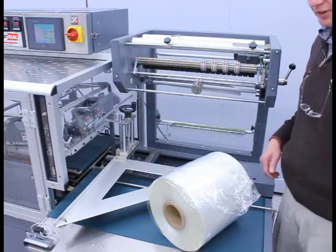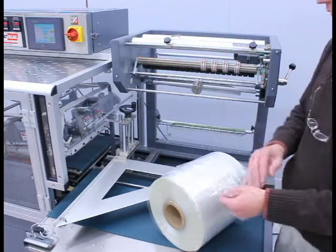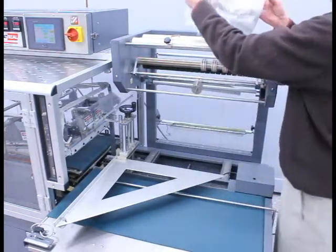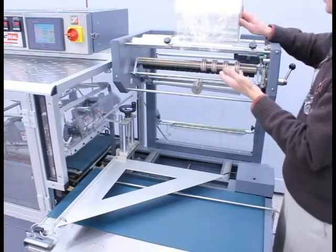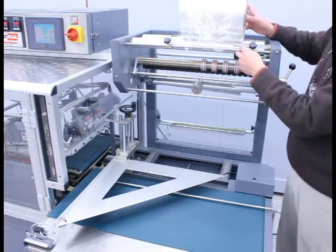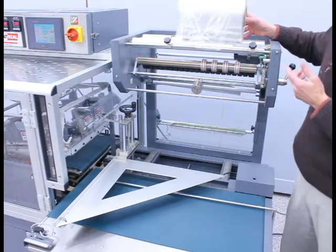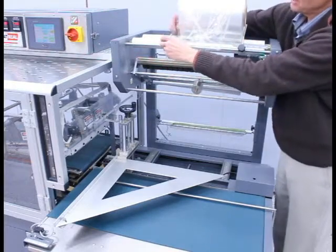The HDSA1721 uses center-folded polyolefin shrink film. The first step is to locate the open side of the film. The roll is simply loaded with the open side of the film facing the electrical control box. The roll can then be slid over to match on the scale the approximate height of the product — for example, a one-inch high product places the edge of the roll at the one-inch mark. The last step is simply sliding the roll guide into position and locking them down.